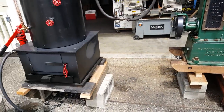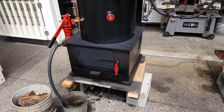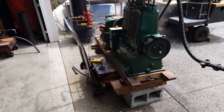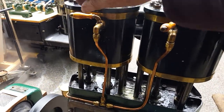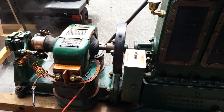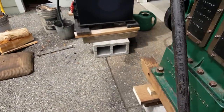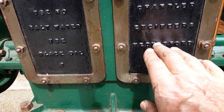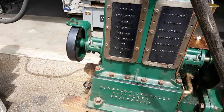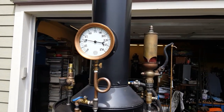It's just running off one of my 20-inch boilers and it does pretty good with it. If I had a better fire going it would keep up with it. The try-cocks are right here. It has an oil bath in this area — the crankcase is in an oil bath, 30-weight oil up to about here, and you fill it with oil here. Beautiful parts. Now we're down to 35 pounds of pressure — I don't have a hot enough fire.